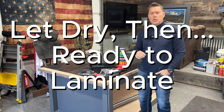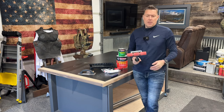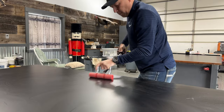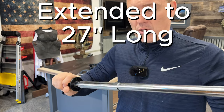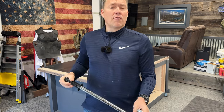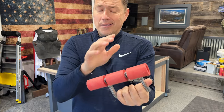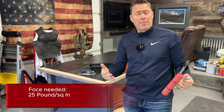Let's go over some of the basic tools you're going to need. One that ranks high priority for me is this extendable heavy-duty floor and wall roller. It's seven and a half inches wide and 17 inches from top to bottom. However, if I rotate and extend it out, I can make it go up to roughly 27 inches long. That allows me to get a heavier distribution of weight, because later on you do have to apply a certain amount of force — around 25 pounds per square inch — for the bonding to happen at efficiency.